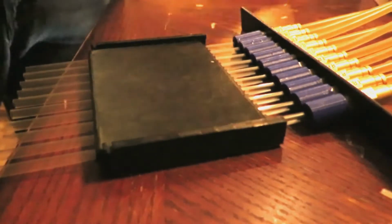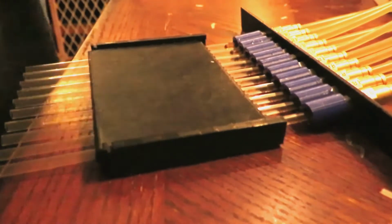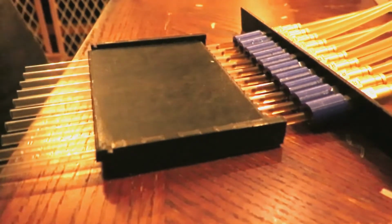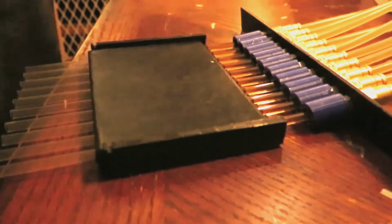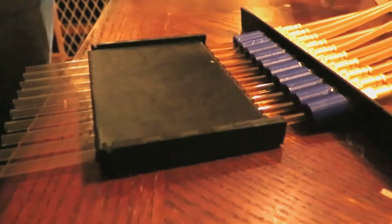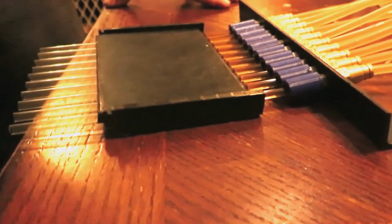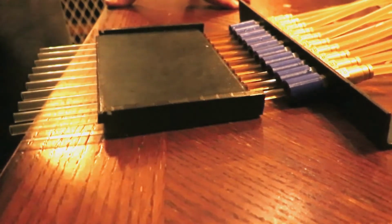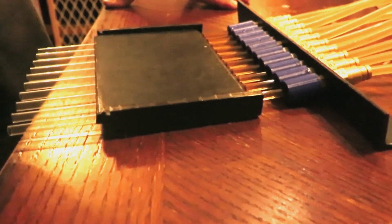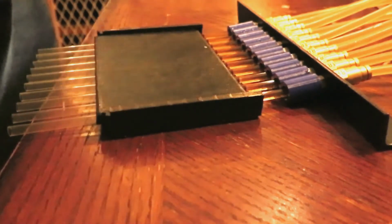One thing too, these valves here on this manifold, I don't want to use this type of valve. This is not a good way to meter the flow. I'm going to be using a needle valve, and that'll be a lot better adjustment. I will make a new manifold, probably out of aluminum, just because it's a little easier in the machine. And I might stagger them on like a square stock aluminum, so that way they kind of fit in a nice tighter little block. We'll still have the tubing.